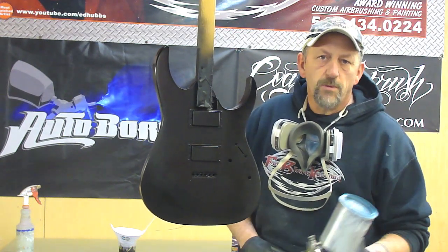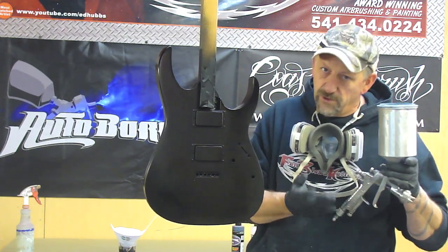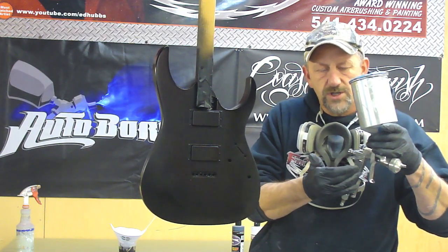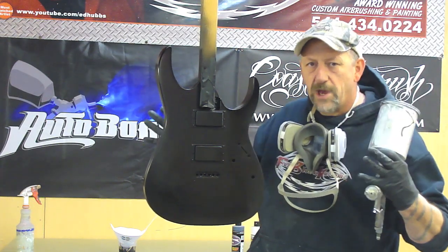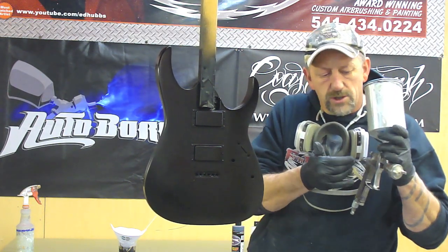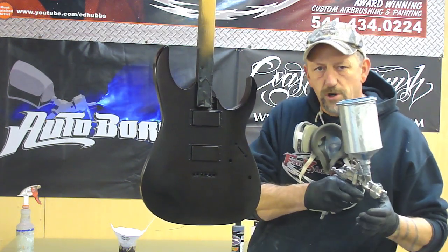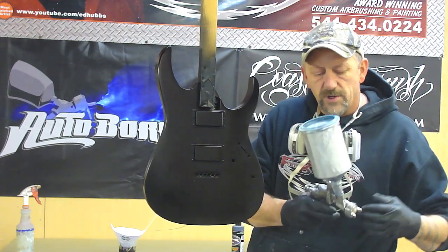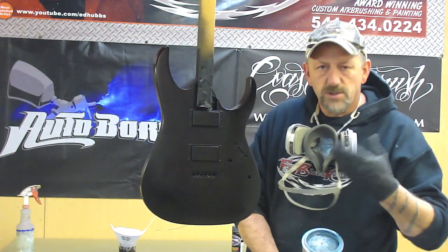Something to remember when you're spraying: I only use about a quarter trigger. On the back of your paint gun, you can turn the knob to adjust your trigger flow. If it's wide open, it'll spray a full pattern and get it really wet. If you choke it down by turning your knob, it adjusts the pattern so you're spraying just a little bit. I use a partial trigger — just pulling it a little ways — which creates airflow and lets you put a little bit of paint back and forth, which helps speed up the process.